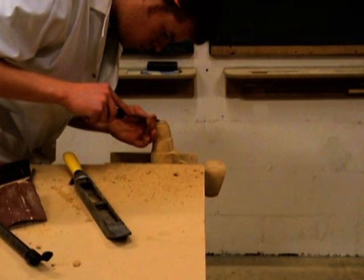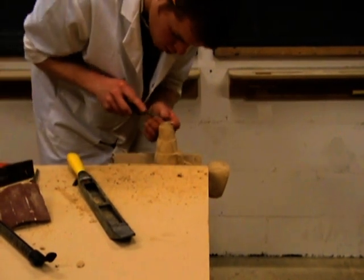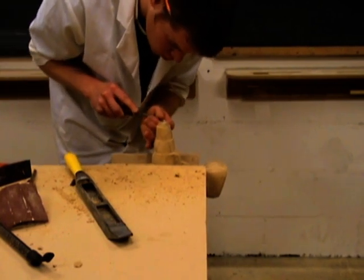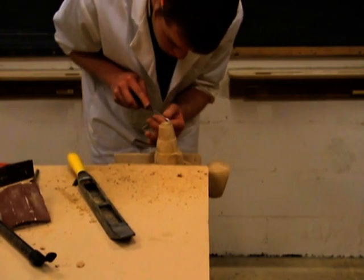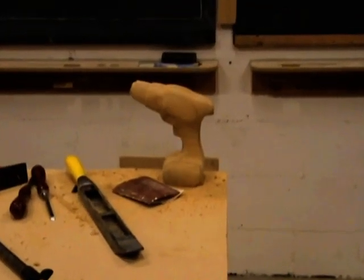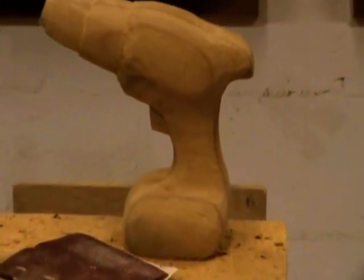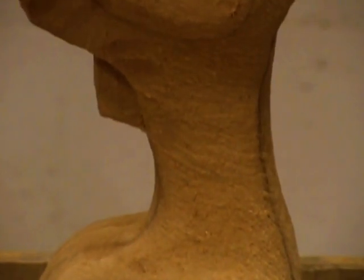As your work nears completion, it may become difficult to hold the vise. Therefore, you must be more cautious as you work. Try to work on the areas closest to the vise to counteract this. When the piece is looked at closely, it is obvious that surform tools do not leave a good finish on the timber. Therefore, it must be sanded before he is finished.